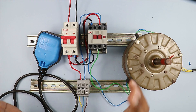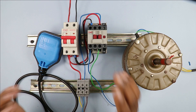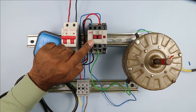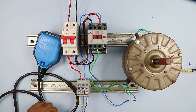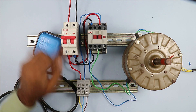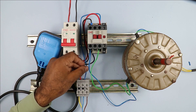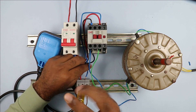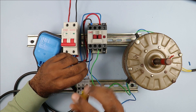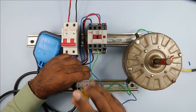This was for the overhead tank. If you want to use this same float switch for an underground tank, you only have to change one wire. What we did just now — with this wire we were providing phase supply to the contactor connected to the blue wire. We have to disconnect that wire and connect it with the brown wire instead.